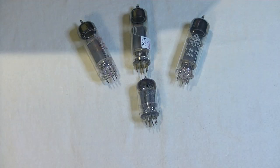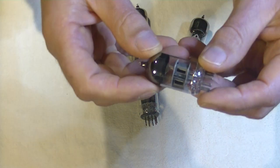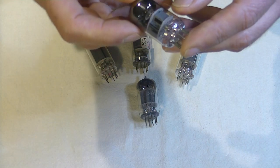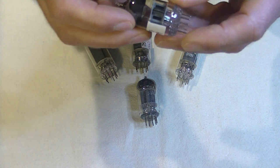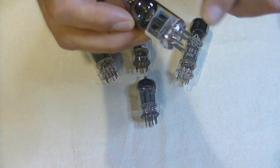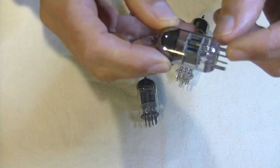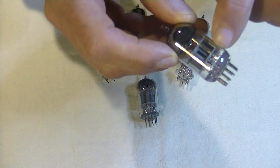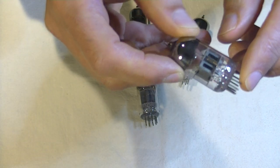Here's a Russian 6N2P. You can almost call this a 6AX7 — it's so close. It has the same gain as the 12AX7, though it's a different tube structure, with many similar parameters. Pin 9 is right there — you can see it snaking over to that little metal shield that divides the two sections, which is a physical barrier that reduces interference and noise between the sections.